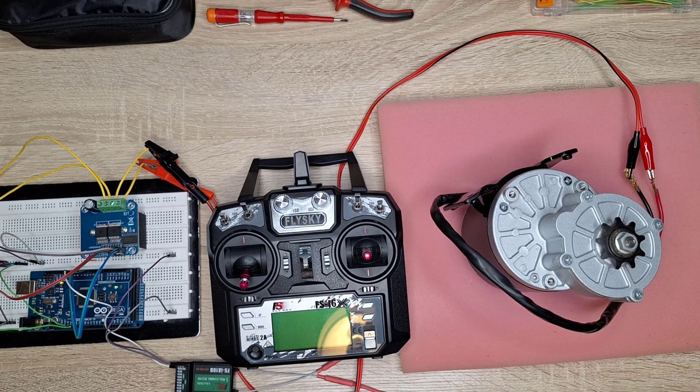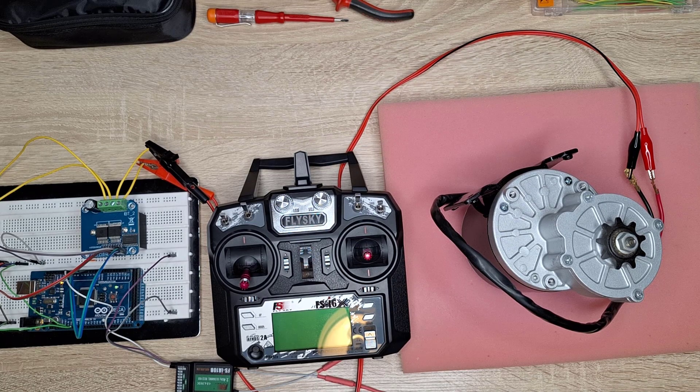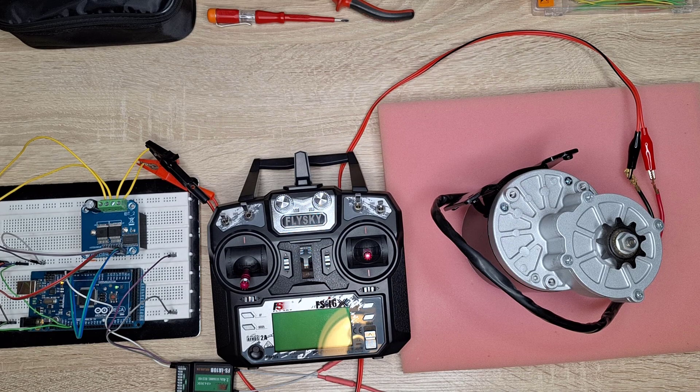I think this is the most important safety feature of a remote control lawnmower. You can stop the motors if something goes wrong. You can also stop the gasoline engine if you connect it via some sort of relay — the rest is up to you.